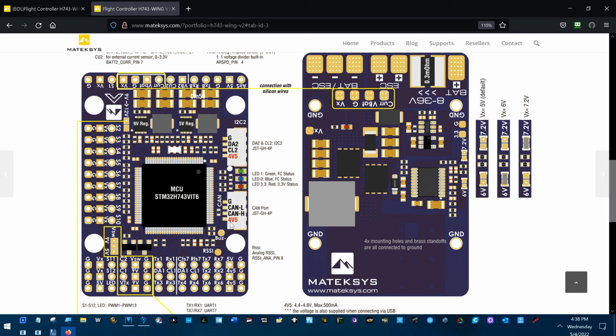But see, in this case you would have a problem of putting a Crossfire RX Pro on these wires, a compass on these wires, or if you had a compass that was CAN, hooking it to these wires, you're just loading down that 4V5 more and more, and then my intention is to hook the airspeed sensor into this connector without any kind of need for any kind of wiring harness. Like I say, I would have ordered CAN GPS modules if I knew this was 4V5 voltage.